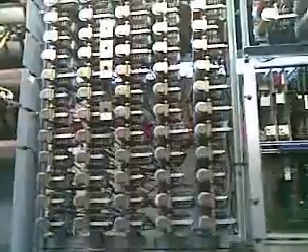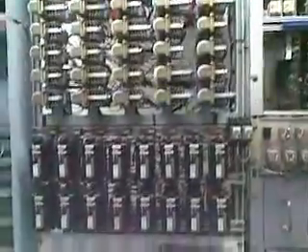Really good equipment in its day. Plenty of relays there, and all the contactors. These are very good contactors — these are a Sprecher and Schuh. Very easy to service. There's just these two clips, one on the top and one on the bottom, that come apart and you can just pull the contacts out and easily replace them.